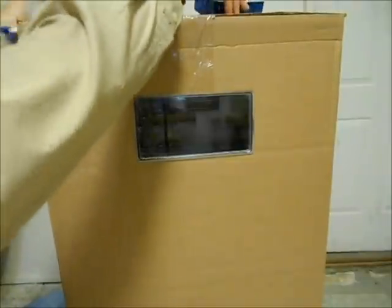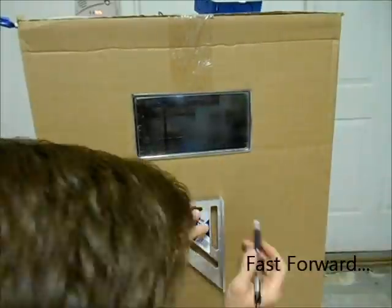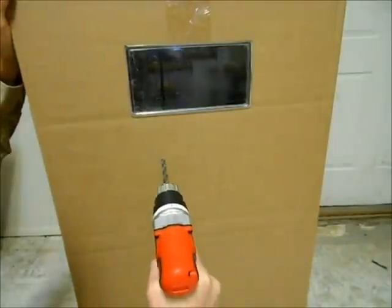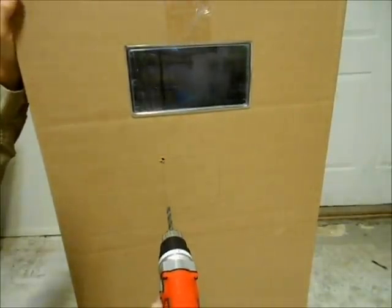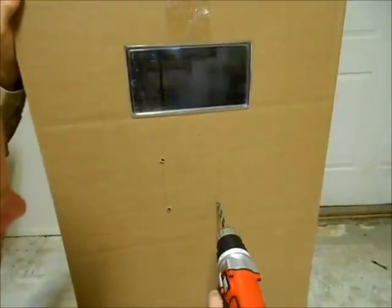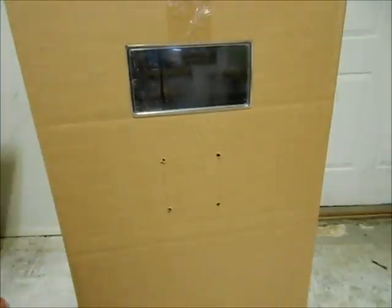First I'm going to draw a 4-inch square — very easy to do. If this were truly cardboard that I was going to use for my incubator, I would use a blade to cut that, but we're assuming this is wood. So I'll show you how to cut a nice square in wood. Take a drill bit that's large enough to fit the blade of your jigsaw and drill holes in each corner.